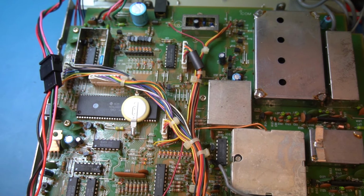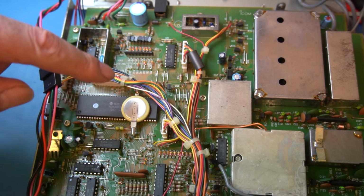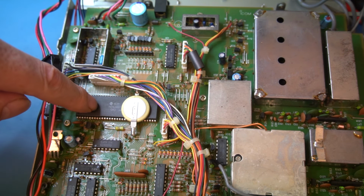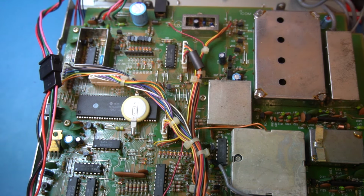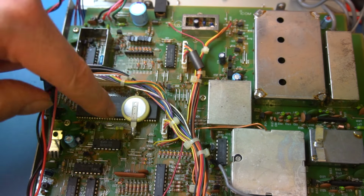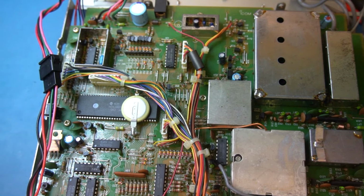whinging. But if you look here, the docs say it's a CPU, but it's a microcontroller unit, so it's complete. It's got a CPU, there's some memory in there, obviously RAM, and I would imagine EEPROM built into it. It's an 8-bit unit, quite primitive. It's quite functional though. It does exactly what it needs to do for the radio. And these diodes at the top here literally just connect onto pins, and as it's going through its program, if it knows that these are out, or whatever configuration they're in, it'll behave in a certain way. So it's just how it's programmed.